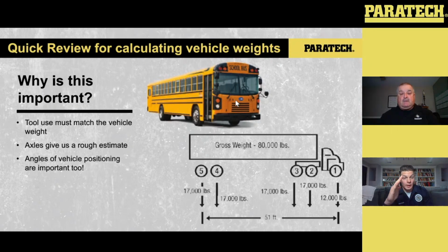And then if we're up even higher, we're dealing with 25% of that load. So we're continuously cutting down those forces that are being exerted. So 15 is 75%, 30 is 50%, and then 45 is about 25%. And essentially what's happening is that as we go higher and higher, we're dealing with more forces being exerted down onto the ground or wherever it's pivoting off of, and less on the equipment.